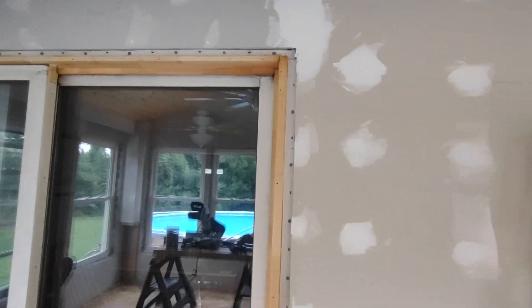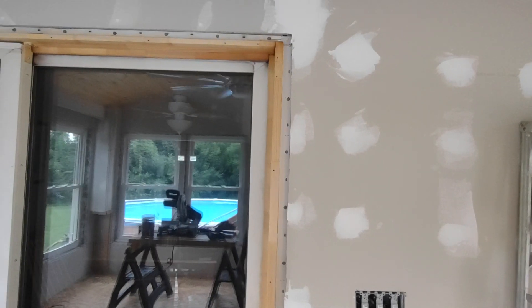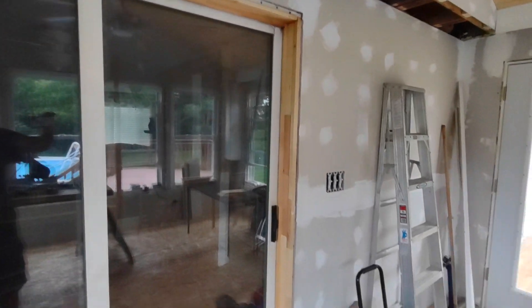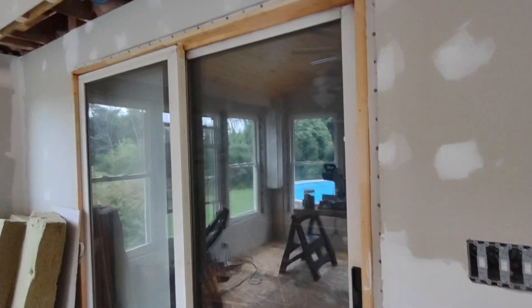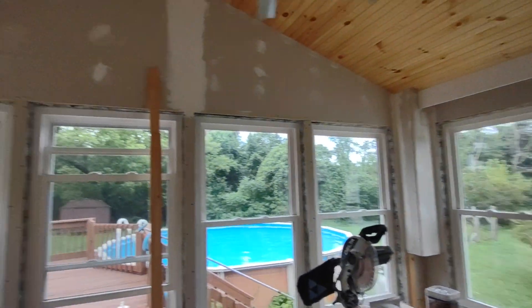The homeowner took the cladding off of the wood frame on the slider — this is something I never would have thought to do, I didn't know you could do it, and that's great. The trim is just going to run and butt right to here, which is going to be a cool look. It's nice working with somebody who doesn't have the traditional mindset, and the traditional mindset is really just what everybody else does — that doesn't mean it's right. You can do whatever you want. I'm not going to miter any of these corners; we're going to run a top piece and then run straight down. The top piece is thicker, so it protrudes a little bit, and the verticals butt up underneath it — you've got a little shadow line there that makes things more interesting to look at.